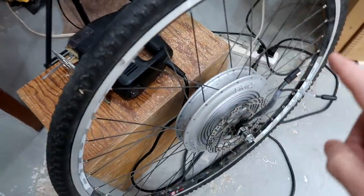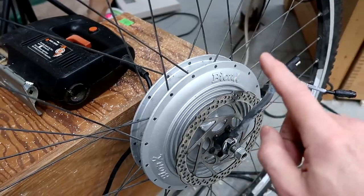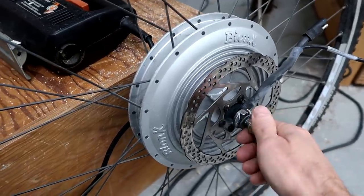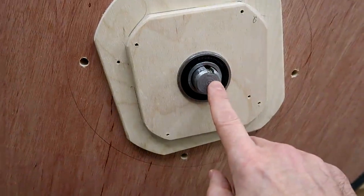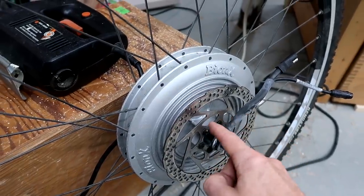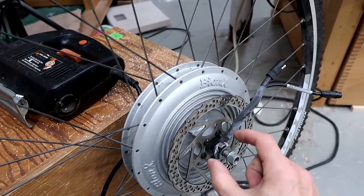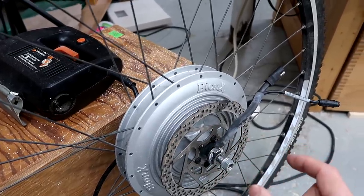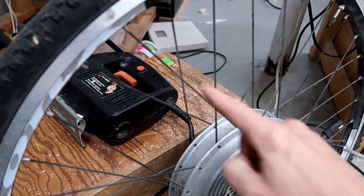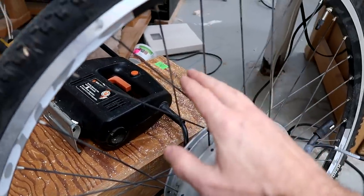This comes up every time I build a bandsaw: why not use a bicycle wheel? It's already got rubber on the outside and a bearing in the middle. This one is actually an e-bike rear wheel — if I found a controller I'd have the motor built right into it. But the problem is it only has maybe a 10mm axle, whereas here I've got a one-inch shaft, so it would need support on both sides otherwise it would just bend. I'd need a complicated bracket to go around it. The logical thing would be to make a new hub taking a one-inch axle, then machine parts for the hub to attach spokes to, get new spokes, and rebuild the wheel — it gets complicated. It would probably be easier to replace the spokes with just a plywood disc.